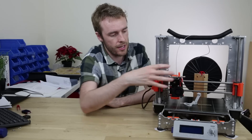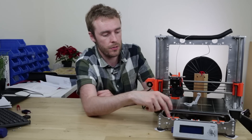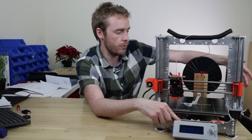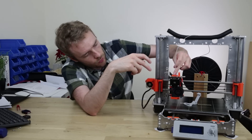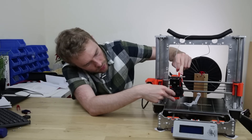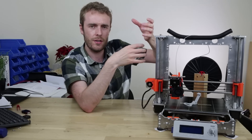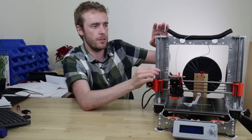The next question is how many printed parts are there on this frame. You obviously have the whole X carriage, which is exactly the same as the original, plus one part repeated four times for the frame corners. In total there are fifteen 3D printed parts. I also put a small piece on the top — it's a little bit broken because I mashed it on — but this just stops the rod from moving vertically, because with aluminium there's nothing to really grip the rod and it can move up with the bearings if not set quite right.